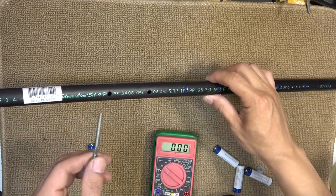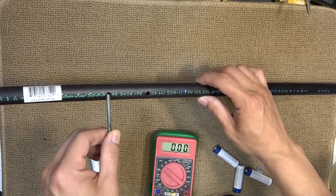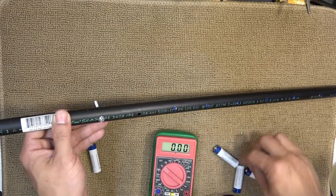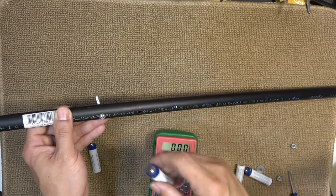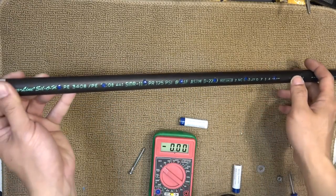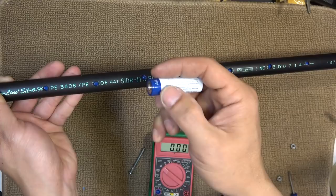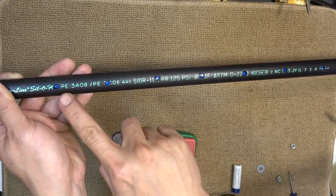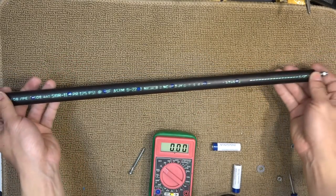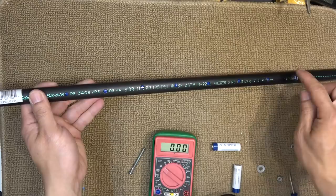So it's gonna work like this: when I push through the holes, this part is gonna be right in the middle, and the flat part is right where it contacts the end of the battery. I've got nine batteries in here connected in series now. You can see through the hole the blue part of the battery — that's the very top of each battery. They're connected this way, but it's not in tension yet because I have to push this down a little so that all the batteries are in tension.